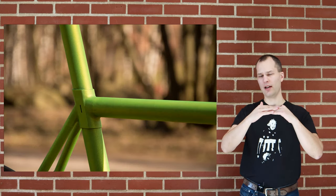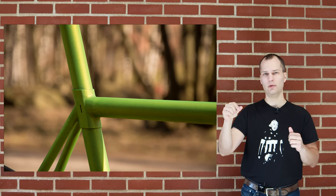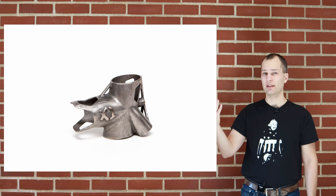In this case we had an overlap weld and modeled slots in the part, allowing us to weld through the slot and ensure good fusion to the part underneath. After welding it's a flat surface — just grind flush and there's no sign of the weld. This is an example of integrated cable stops: here the rear brake cable runs inside the top tube and exits from the rear, with an integrated seat post — not possible with a normal adjustable seat post. For this time trial bike, with the goal of reducing part count, we integrated the derailleur hanger directly into the dropout.